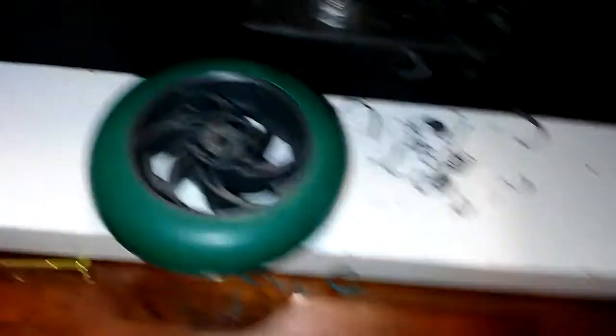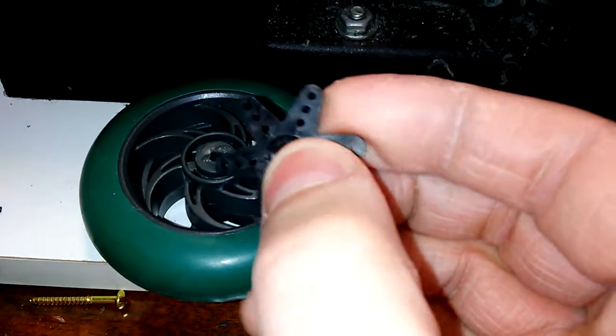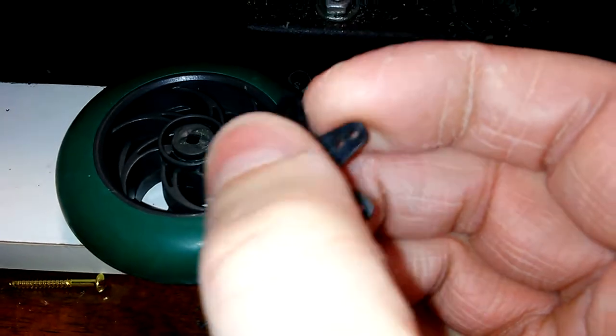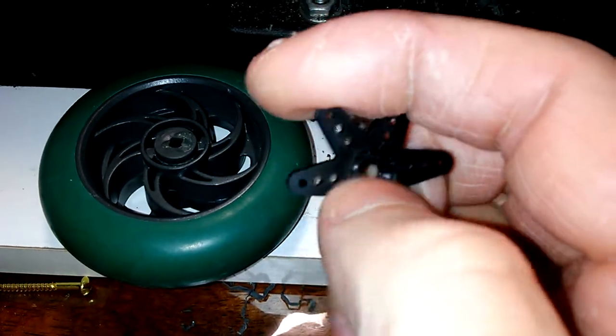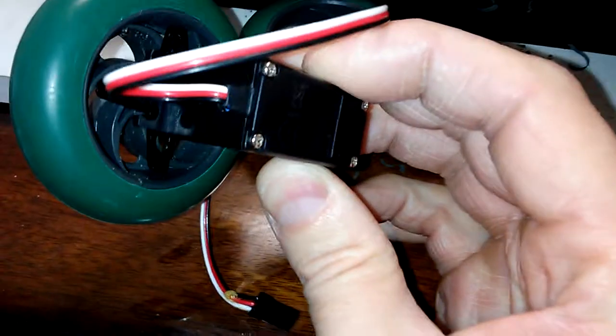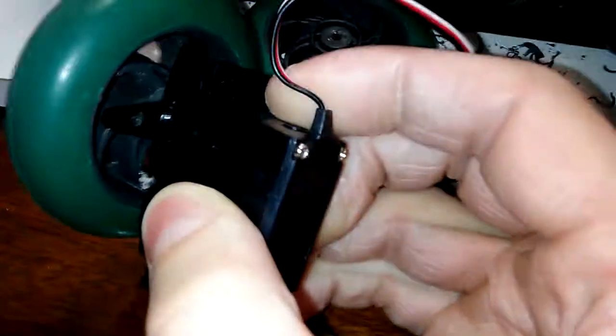What I'm going to do is use a lathe to remove this flange and also carve out the center. There's a little ridge right here — now I could shave that ridge off the horn, but I don't want to. If we shave out the center, that ridge can really help us center the wheel on there when we're putting it on. So the third problem is how do you get the horn to stick to this after we shave it down?